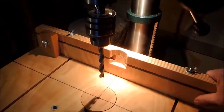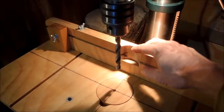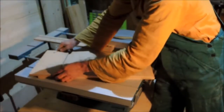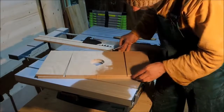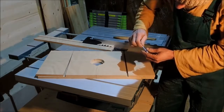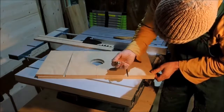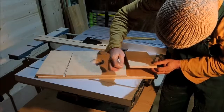And I also made this fence, one of the last things I made here. This with the Forstner bit, 50 millimeters for this head. These parts I glue like this together. And here I need a line for this screw, like 6 millimeters. And this part I need for moving the head of this screw. Then I need to cut a little part here.